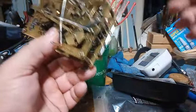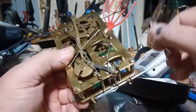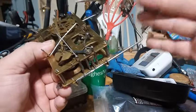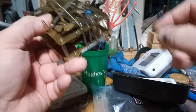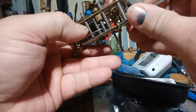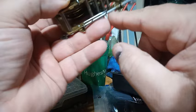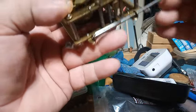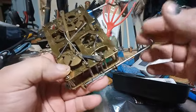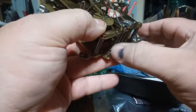This arm right here is called the bird post. That's the post that the bird — whether it's the quail or the cuckoo — rests on. It has a wire right here. It also has a spring on it. There are two purposes behind that spring: one is to bring this bird post back inside the case, and the other is to hit this trip lever.